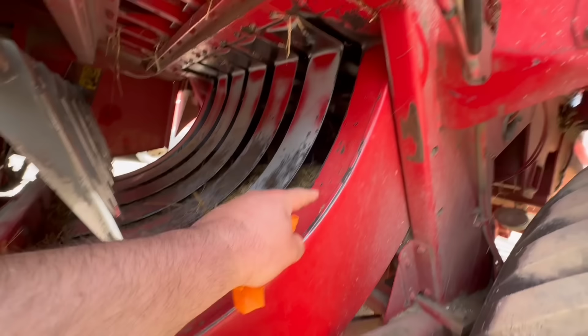We'll start at this end. This is the pressure pipe, pickup pipe, brakes, lights, and I've just got to plug them into the tractor. They sit in the tractor cab. Then this one here is the oil return. So feed, oil back. So it all goes around in a big circle and just keeps circulating all the time.